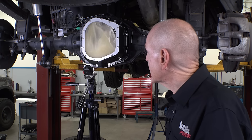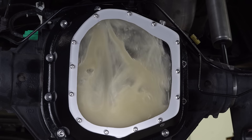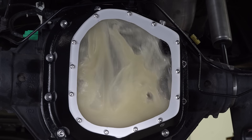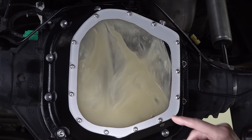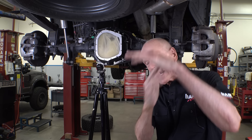Let's go to 30. This ain't good. It sounds like we shifted gears. Just more intense — same problem. It's really starting to put a lot of air in the lube. See how it's getting wider? The aeration that is taking place on that impact and the impact at the top.